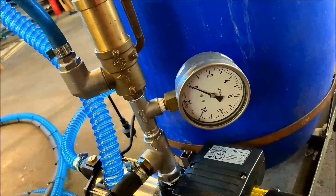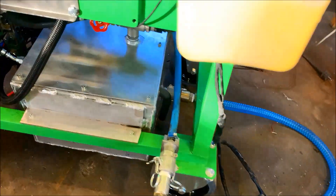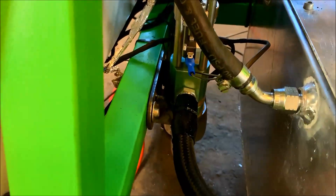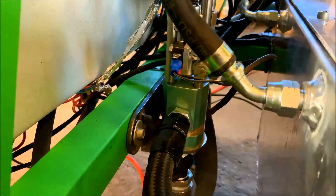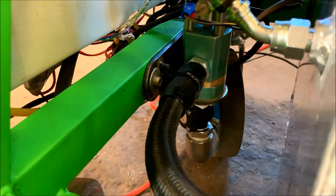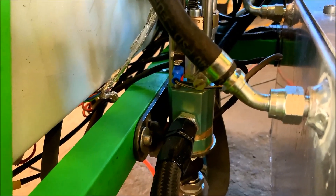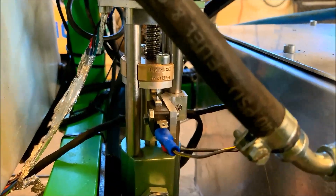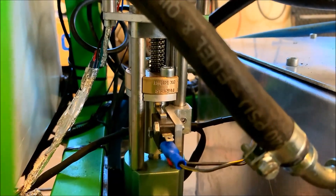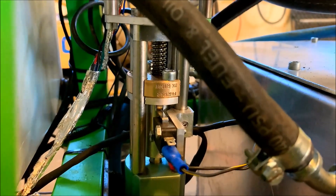There's a manometer to check that we set the correct pressure. Then it goes all the way back into the control valve. Down here is the water control valve — the valve that controls the load of the dyno. On the inlet I have a water flow meter with two separate outlets, one for each side of the dyno. It's controlled by a stepper motor. I have put in a zero position sensor so that the dyno unit can auto-calibrate each time I start a run.